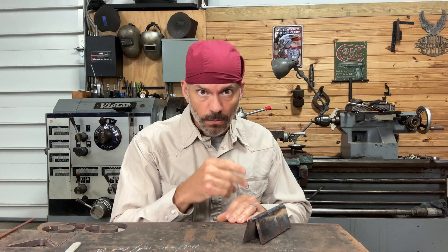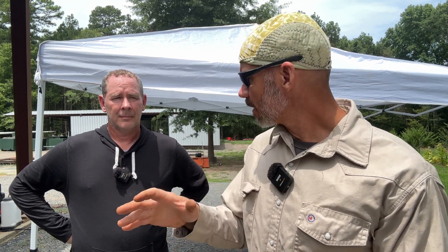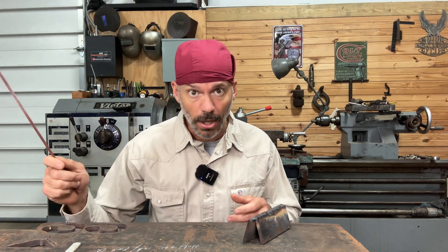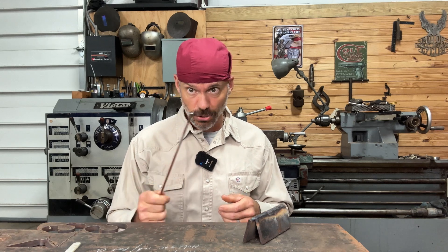I'm going to be showing you this gnarly weld — flick it, don't stick it, come back — it's a bunch of restarts, because that's what I want you guys to do if you're struggling with this. I was teaching a guy the other day, Michael, how to weld. He spent more time stuck than welding — that's part of it. We are welding with 5/32 6010s that have mold growing on them and rust on the end. Fresh rods will help. There is no bad welding machine, but if you're using an old tombstone, combining bad rods with a bad welding machine won't work.